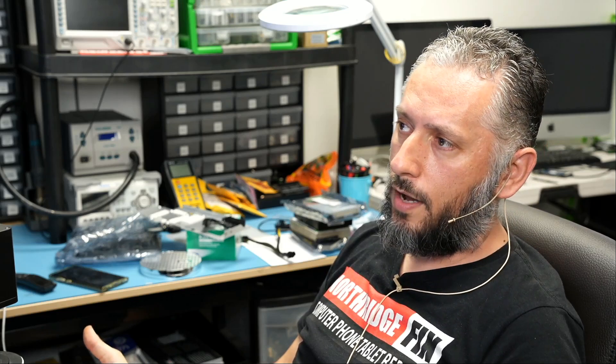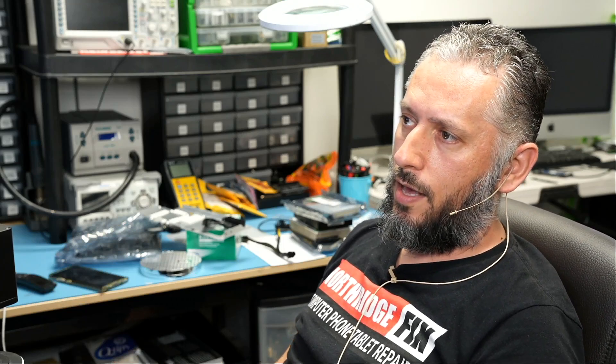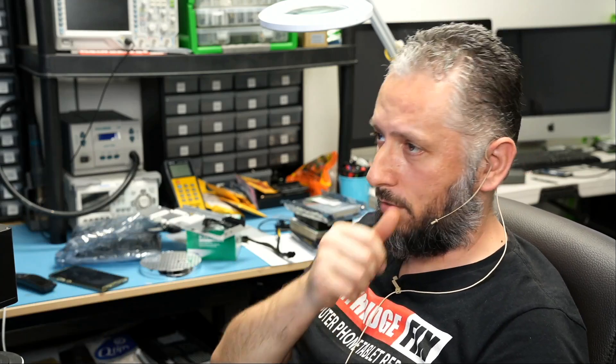I don't know what's going on — I've never fixed one of these machines before. I asked Big Boss to remove the motherboard so I can look at it and try to figure out what's going on. If I'm not able to fix the board, my next option would be to buy the controller board, which is about $280. If the problem is not the controller board, my guess would be the motor. The two main components on that device are the motor and the control board.